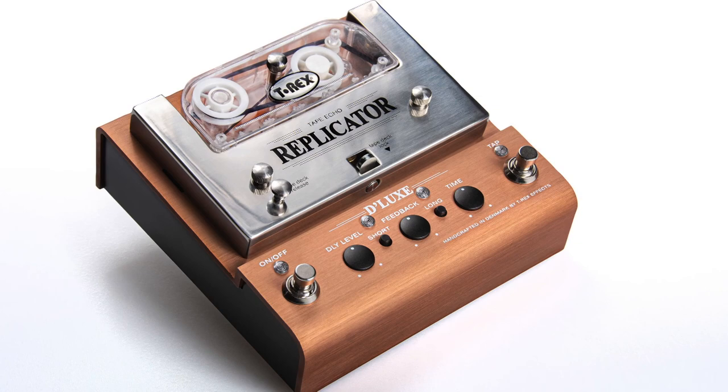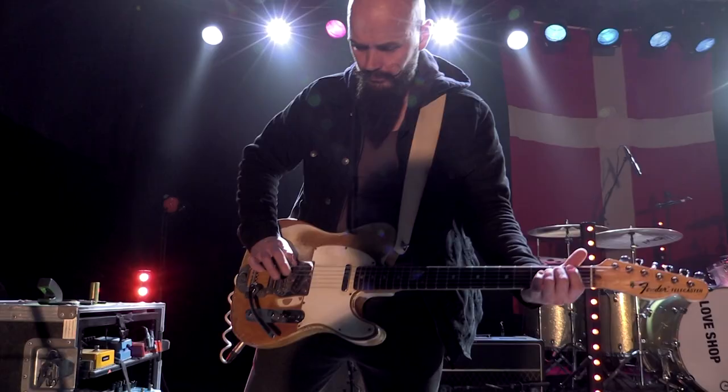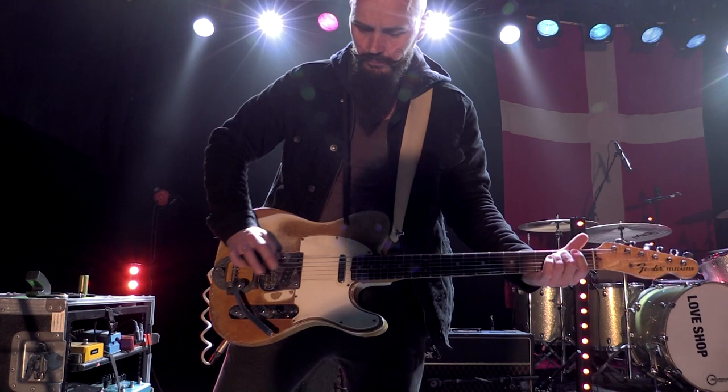One of the inspiring things about the tape echo is that it's a little bit unstable, so to say. It's random. When a tape is moving through the head, it's not always 100% stable, and there's nothing wrong with the tape, it's just how it is, and it creates a lot of good things. Harmonics, and also some phase things happen. And that's the secret about a tape echo. And on top of all that, if you squeeze your signal a little bit, then you'll hear fantastic harmonics.